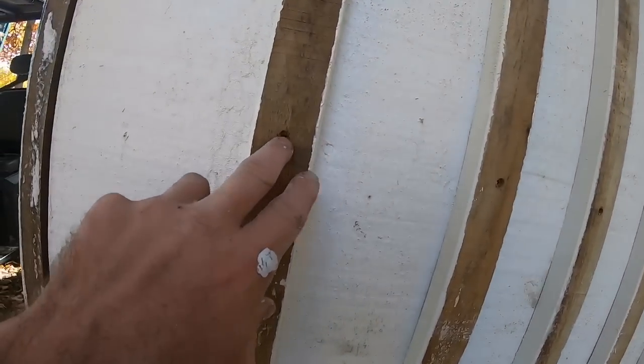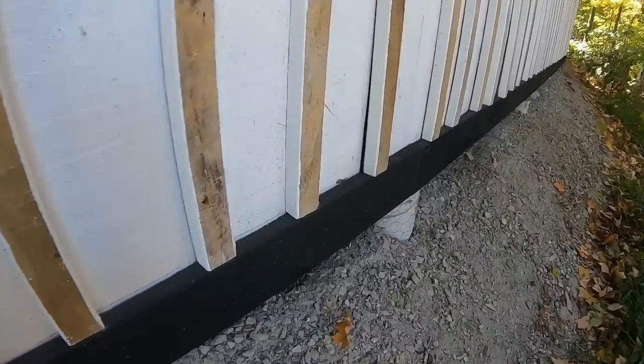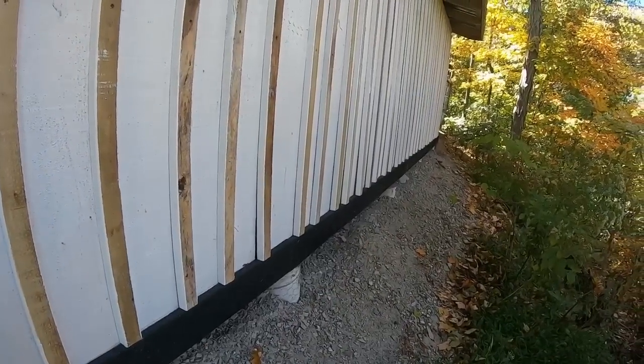Looks good. 4-inch screw between two boards there and on that row there. And then I am gonna go down. You can see the bottom. Some of these are kind of kicked out. I'll go down with those little 2-inch screws and just kind of try to tack them in place. Keep that bottom from warping out over time.